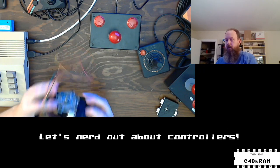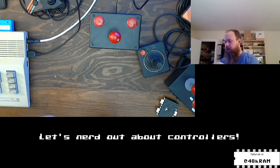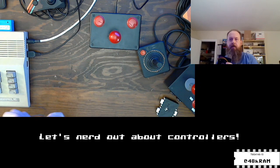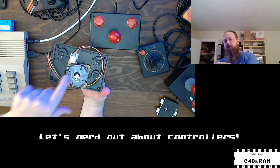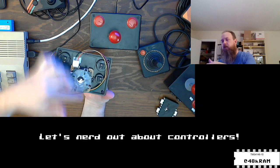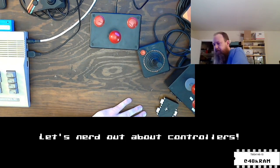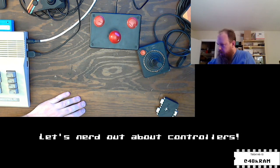On a real arcade cabinet you just tilt down the control panel and swap the gate out — pretty easy. That's the inside of a Sanwa Japanese arcade stick. American arcade sticks often have leaf switches instead of micro switches — like Donkey Kong, where a big washer hits a large leaf switch. The action feels very different from the Japanese sticks.